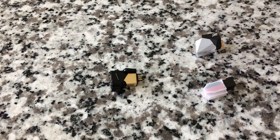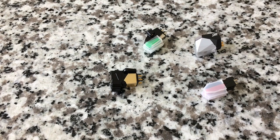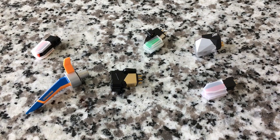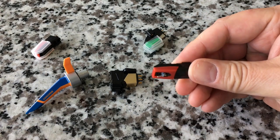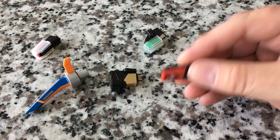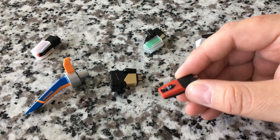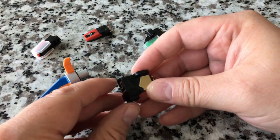Manufacturers make cartridges to different specifications for design purposes, brand identity, and functional reasons. The two basic types are ceramic and moving magnetic. Ceramic are usually the red-tip ones you see on suitcase players and entry-level players, although not always — there are magnetic cartridges with red tips too. So that's not a fail-safe way to identify a ceramic cartridge, though 99% of the time a red-tip cartridge on a suitcase or all-in-one player is going to be ceramic.